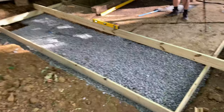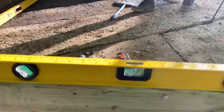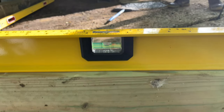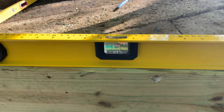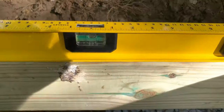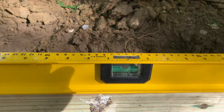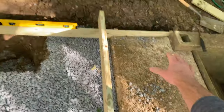At this point we have the outside forms put in place. Then I put one on each end and took the level of it — we look pretty good level there. We're not planning on draining it to either side. Instead, we have a slope going away from the house, so the water is going to drain away from the house.